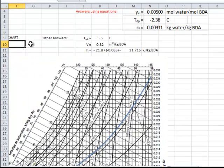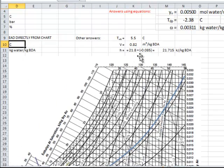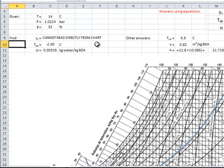Using this, you can get out a chart and follow along and see what else you come up with. But I came up with 21.7. Actually, I got ridiculously 21.715. I'd say 21.7 kilojoules per kilogram of bone dry air. For the humid volume, using these lines across this way, I got about 0.82 meters cubed per kilogram. And the wet bulb temperature of 5.5. So again, try these on a graph of your own and see if you too can read these values. And then we'll come back and we'll work a problem using these in the next video.